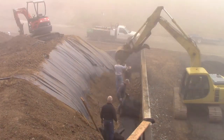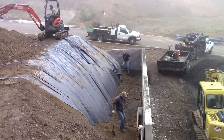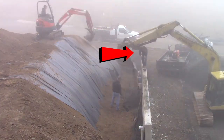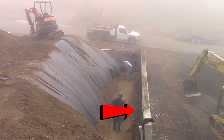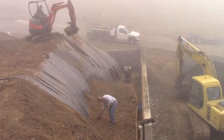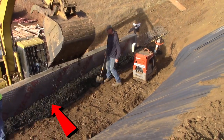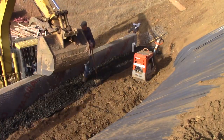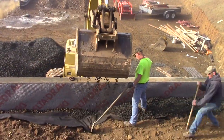As we come up with this material — the rock and the filter fabric, then the native soil, then the rock and the filter fabric and the native soil — you probably notice that we're maintaining a layer of rock against the face of the wall. We're wrapping it in filter fabric and maintaining that layer of rock all the way from the bottom to the top of this wall. We're doing that to eliminate the possibility of something called wall jacking.